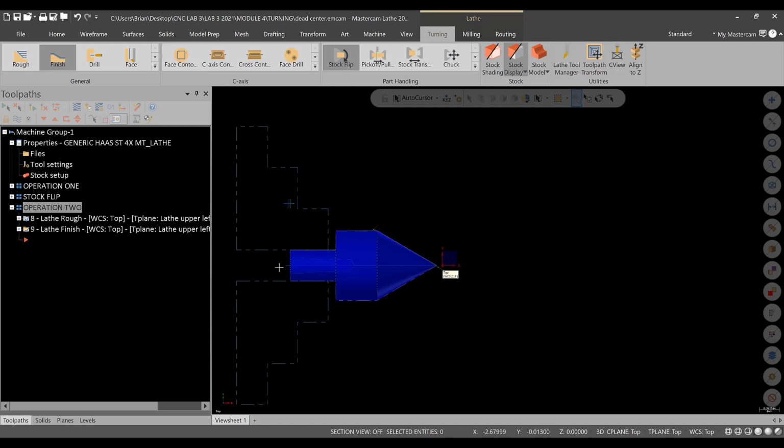It would be the equivalent of touching off the back surface. So if you could contact the back surface, then compensate 1.75". That would be what we're doing here, except for we're touching off here and compensating here. So you got to make sure that you take that into account. All right. So if you know this is 1.75", what Mastercam thinks is, and it's not, you need to take into account the difference between 1.75" from where you currently are and add or subtract that from your G54 Z offset or your tool lengths, depending on how you're going to adjust it. All right. So hopefully that was clear.